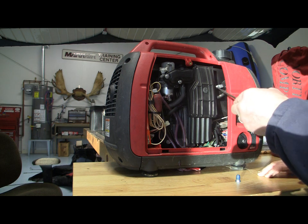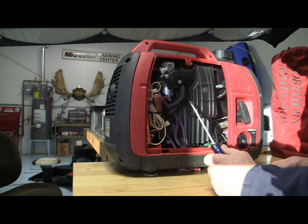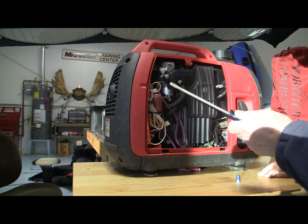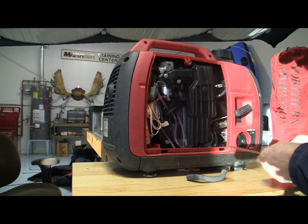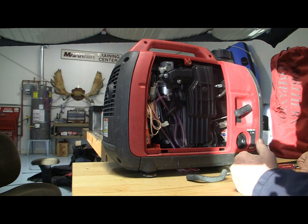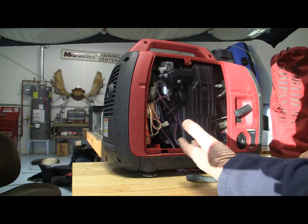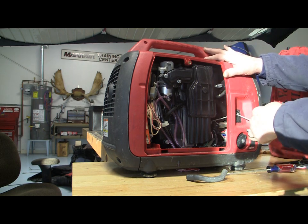This breather with cold air circulating through the engine compartment may freeze — and it will freeze in sub-zero temperatures. So if you have one of these and the engine is quitting on you, the easiest short-term fix is to remove the breather. What I would do is wad up a paper towel and lay it in there, because your crankcase vent is totally open now and you're going to get fumes and oil vapor out of there. But the engine will run, and you can operate it, get your airplane preheated, and get home.